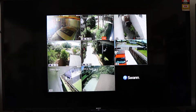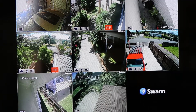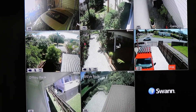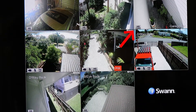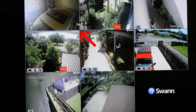So that's what we are seeing at the moment. When I zoom in, the only thing I noticed had changed is that there are lines running through the feed. You can see these lines running down over here. I think it has to do with the temperature — when the temperature is a little bit more hot and the cables are maybe exposed, I find that these lines sometimes appear. It happens on this one in particular, and also this one, though this one has been much better now because I've made it more protected from the heat on the BNC cable. But this one is in the garage, so the garage gets quite hot.